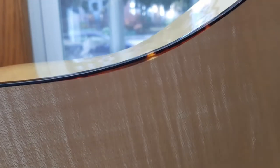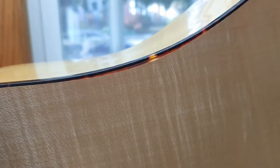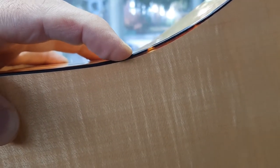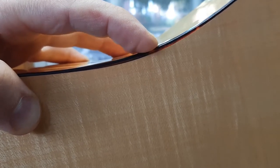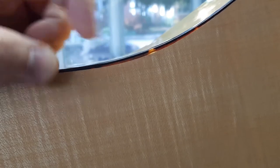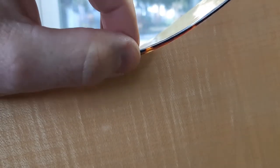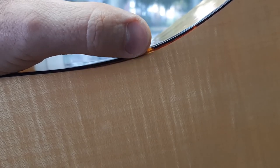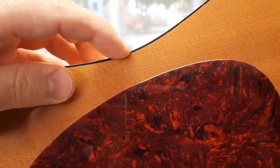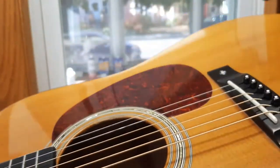Here's a close-up of what is going on here. It is only happening in one of the corners on the guitar — in the waist area. You can see that it is coming loose and it has shrunk enough that it does not want to push back down into the binding channel. You can see it popping up there. I did check the other three corners and they are all perfectly fine. So we only have it in the one corner, but who knows, maybe down the road these other corners may end up coming loose.